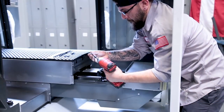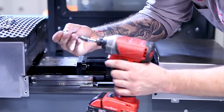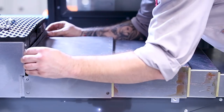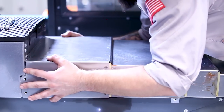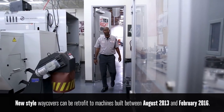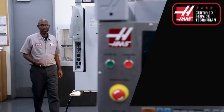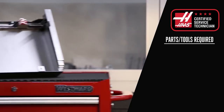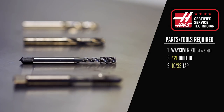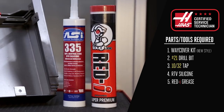In August 2013, the VF1 through VF5 machines changed to a new revision of X-axis wiper covers. The new wiper covers have a slightly different mounting configuration — they attach directly to the guide bars, which provides a stronger support. Some slight modification may be needed for machines built when this was first introduced. The following tools are required: a way cover kit, a number 21 drill bit, a 10-32 tap, a tube of black RTV silicone, a red-eye grease cartridge, and a scraper.